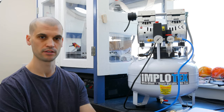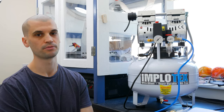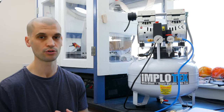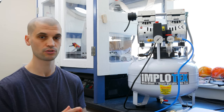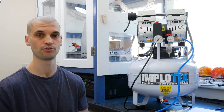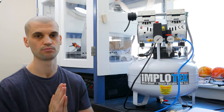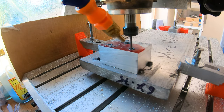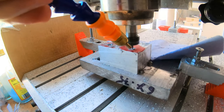Overall I'm very happy with this compressor. I'm glad I finally made the dive into using air on my CNC — it really does help to mill aluminium much better. You get much more quality cuts, especially using coolant, which helps with lubrication, reduces friction, and keeps your tools cool. It helps with tool life and surface finish, and it does allow you to push your machine harder. For instance, I was boring a 25mm deep pocket with a 3mm single flute end mill — I would not have been able to do that operation without air and coolant.